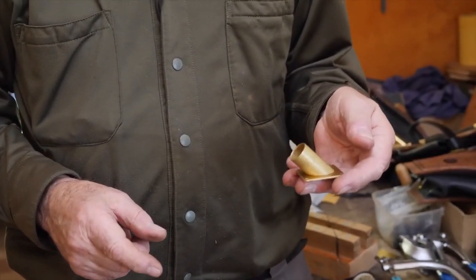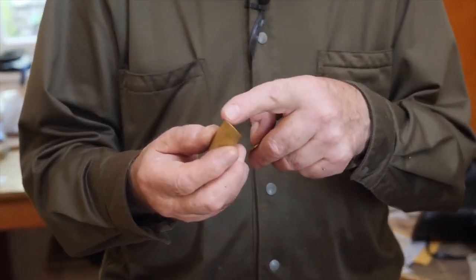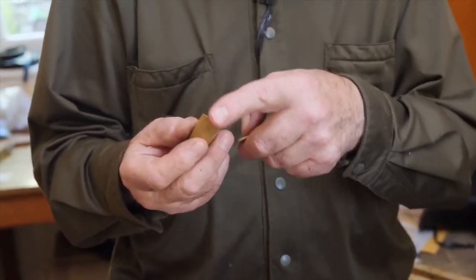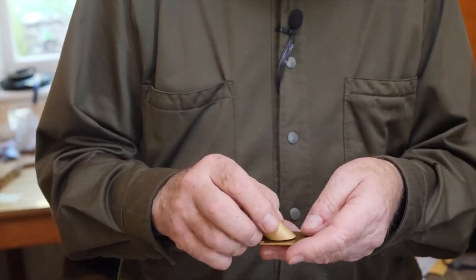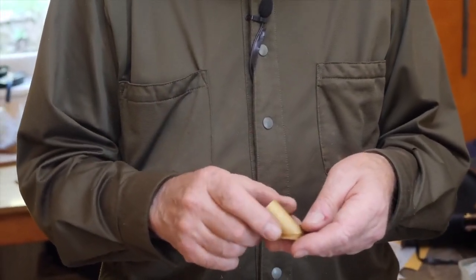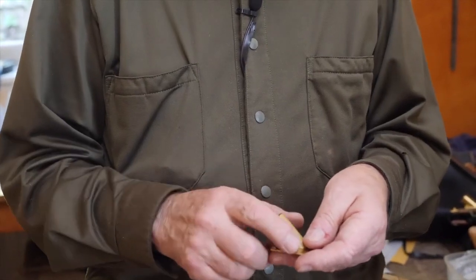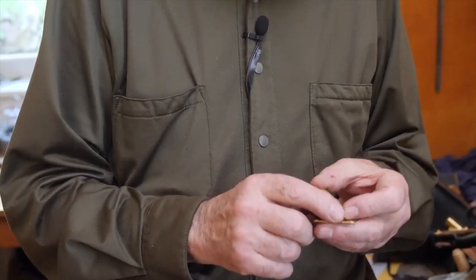But you don't clamp it or wire it or anything? No, just like that. But before you do that, paint a bit of flux around there. And sit it on there, and then a little bit of silver solder, just lie it next to the joint. So you clip little bits of silver solder and position them, rather than silver solder wire? About a millimetre, just over a millimetre thick anyhow, and about half an inch of that would do.